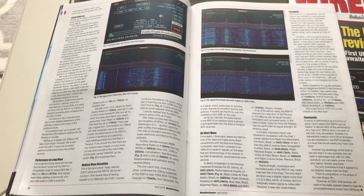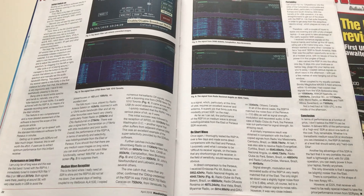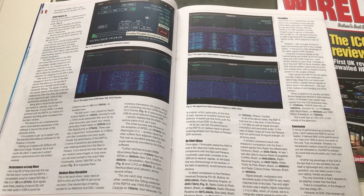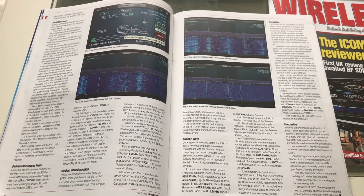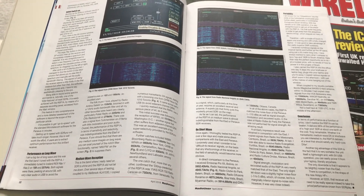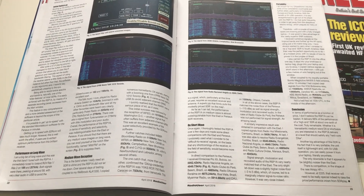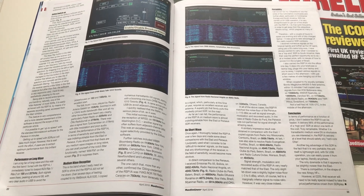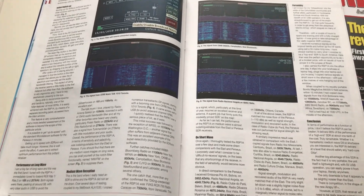I had quite a few transatlantic medium wave catches on this little SDR, and I think I copied Caracas from Venezuela on it. Sensitivity and selectivity with the Wellbrook — there was not much difference to the Elad, to be honest. The noise floor on this receiver was slightly higher on some bands, but for a tenth of the cost you'd let that go. In terms of selectivity, it's got all the bells and whistles of the Elad FDM software. The only difference I found was that without the medium wave broadcast notch you get a lot of spurious signals on long wave, but the notch filter removes them, so it's superb.